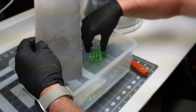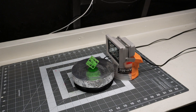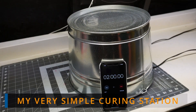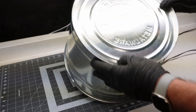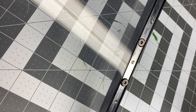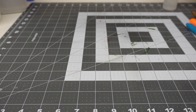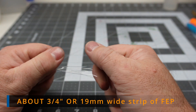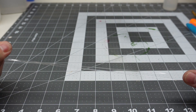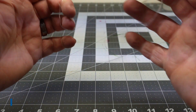With the flex plate you can just wipe it off and put it back in — no big deal. My very simple curing station is just a galvanized bucket, a light, a turntable, and my phone as a timer. I cured it in a couple of minutes — the result is clean and clear translucent. Here's an image of the FEP; I had replaced it previously because of some issues. When I replaced it, the strip of FEP is only three-quarter inch wide but it stretches to about 14 inches before it breaks — you don't have to be as nervous about it as you might think. It's pretty strong plastic.